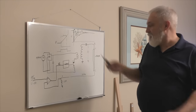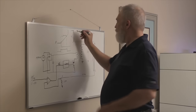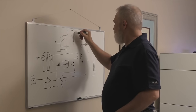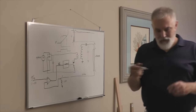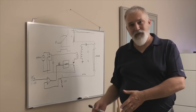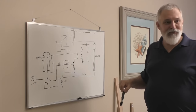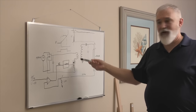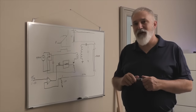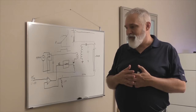It's important to know that the response curve — whether you're willing to overshoot a little and then settle — will have the same shape regardless of whether you're going from zero to 20 milliamps or between any two values. The engineers who do this are magicians. The Chinese are actually very good at magnetics — that's what's in our power supplies. Now Russ, you asked about using power supplies with different size tubes, so I'm going to show you some things.